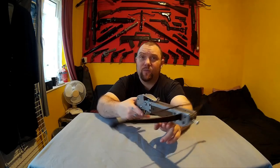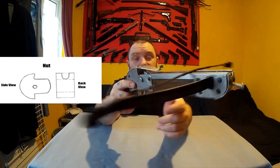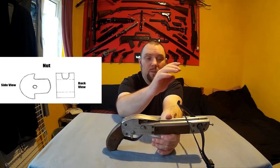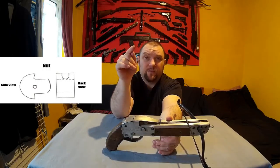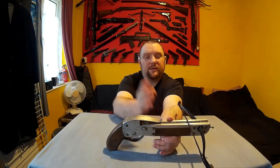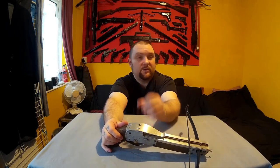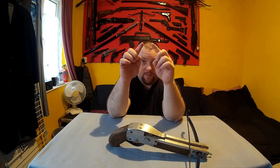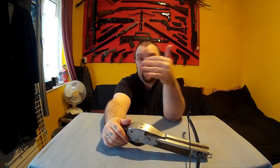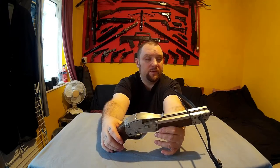One other thing I didn't mention: in this roller nut there's a groove in it. What that does is — without the groove, what can happen is the string can jump over the bolt, so you end up having to have the bolt slightly forward, and it makes it like the string is almost hitting the bolt. With this method, all you have to do is a little bit of adjusting on the bolt flights — you just cut a little bit off the flights so they sit further back and are actually touching the string to start with, which means you never get a misfire.